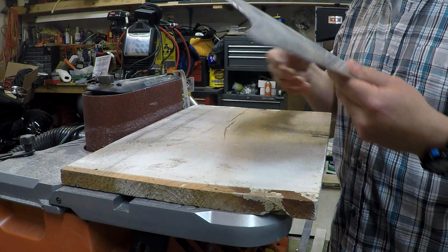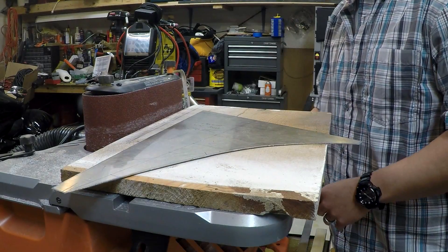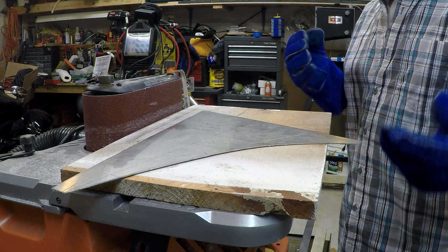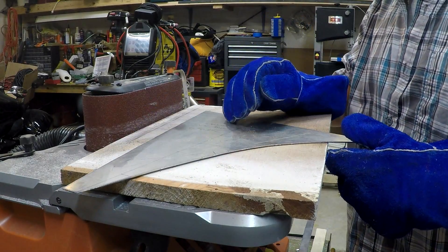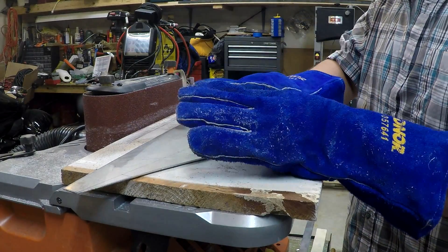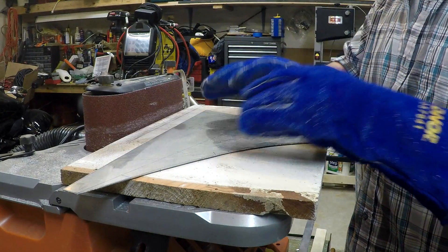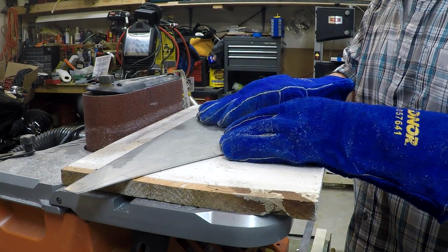I'm going to let the camera roll here and show you what I do. Wear safety glasses - that's extremely important. I also have my shop vac connected to the dust collector on this. The other issue is when you're sanding lengthwise like this, the metal heats up very rapidly and gets way too hot to handle, so I'm wearing arc welding gloves - very heavy leather insulated arc welding gloves - so that I can hang on to the metal and manipulate it on the sander.